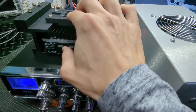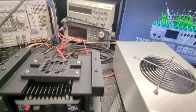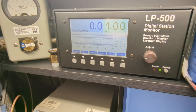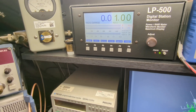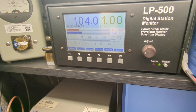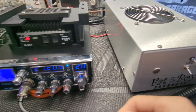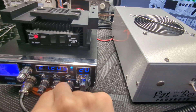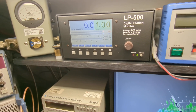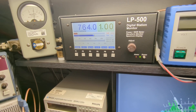We'll put on the driver now. Let me get that on — I'm probably going to have to adjust. Let me turn my mic gain back down. We're a little high now, around 80 watts. So we'll do that for right now. With the driver amp going into it, one, two, three — we picked up another 250 watts or so.